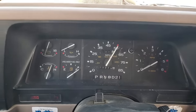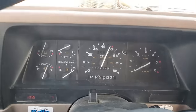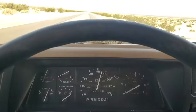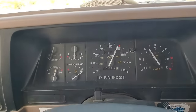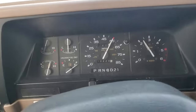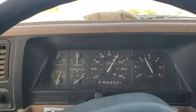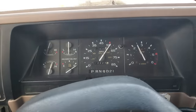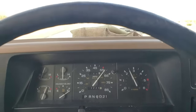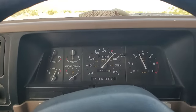He's on his way with the belt, you know, the guy I'm meeting. But this is just killing time and having fun and overheating the engine. Probably stretching the head bolts. Okay, I'm starting to figure this out. The pump is turning because I'm getting hot air out of the heater. So if I just sort of keep my foot out of it, it seems like I'm making it, but the problem is having the heater on, you got a 25 amp motor sucking off a battery that's not charging. So anyway, just something to play with, I guess.